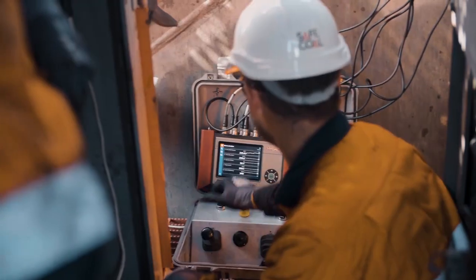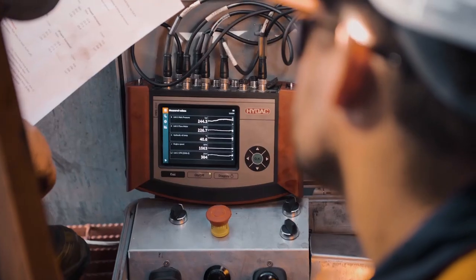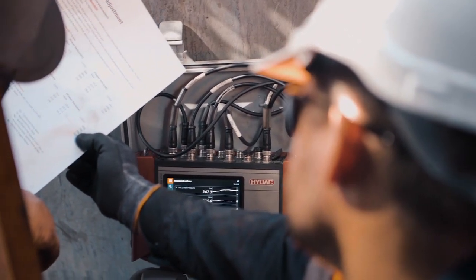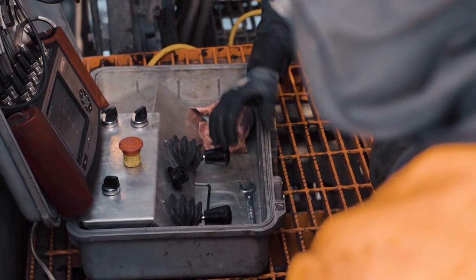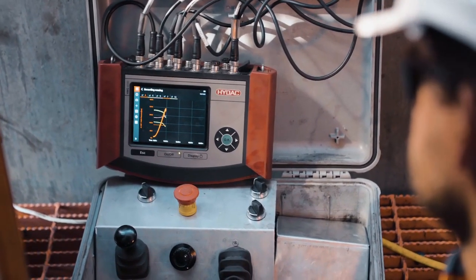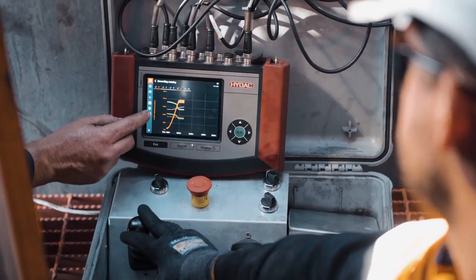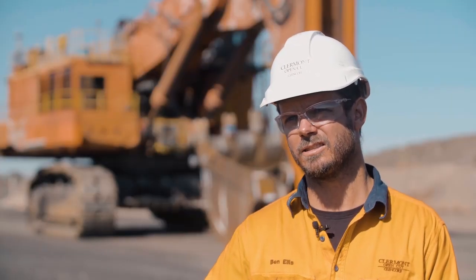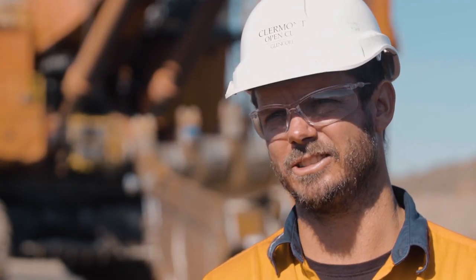From a maintenance point of view, we can pick up a lot more information with the new setup — all data logged down to the millisecond. We've found a lot of early preventable failures that could have quite possibly contaminated systems and caused downtime. It's a lot quicker, and we can wind pressure on and off the pump remotely far quicker than you can with a valve. You can zoom in and check different pressure ranges and different flow points on the graph. A lot of the time when a pump isn't working correctly due to a possible internal failure, you can hear it in the pump while you're in the area. But trying to explain that without some sort of logged representation is pretty hard — you can't pull a $30,000 pump because it sounded funny.